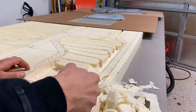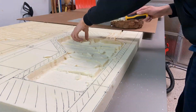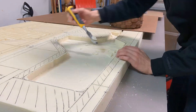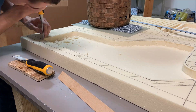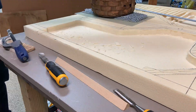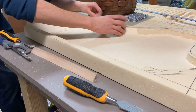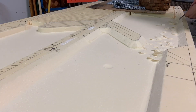And so the phase of multiple days of chiseling had begun. It was necessary to go very slowly to remove all of these raised areas, but this was about the best way I could think of to do it. It was the safest way to do it without damaging the foam or going too deep, and it did result in a very smooth, even surface that was almost exactly one inch deeper than the surrounding areas — and that is what the design asks for. After the center areas were removed, I switched to a smaller chisel and began removing the areas closer to the edge, having kept the router purposely some distance from the edge. I worked it right up to the edge, cut it with a saw at a 45 degree angle, and sanded smooth until I had the exact contours. For some of the more complex curves, I found just using my finger worked quite well — the foam's fragile enough that that works — and so I continued this for quite a while, but then disaster struck.